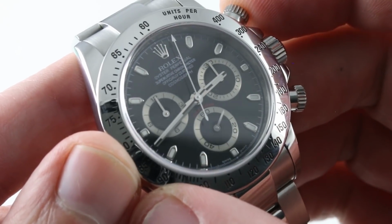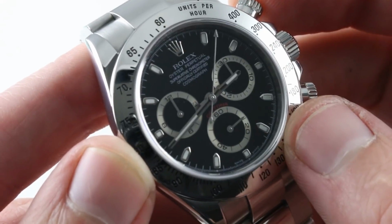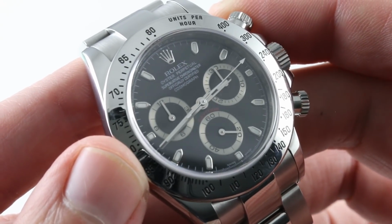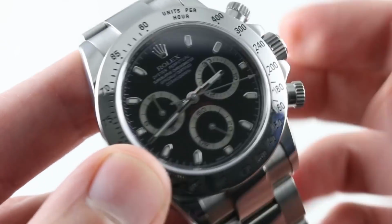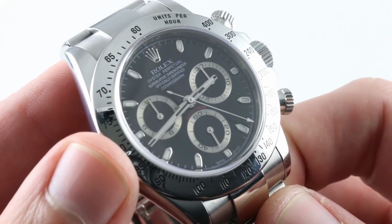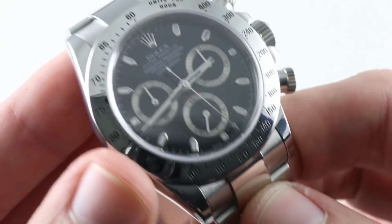The timepiece features a Rolex manufactured caliber 4130. That was new for 2000, and it's known as the in-house generation of the Daytona, 2000 to present. What does it give you? Well, it gives you a lot. It gives you a 3-day power reserve, automatic winding, a 4 Hz beat rate. It is a COSC certified Swiss chronometer. It features a full balance bridge with a free-sprung index for shock resistance, an overcoil hairspring for resistance to positional or gravitationally induced timing deviation.